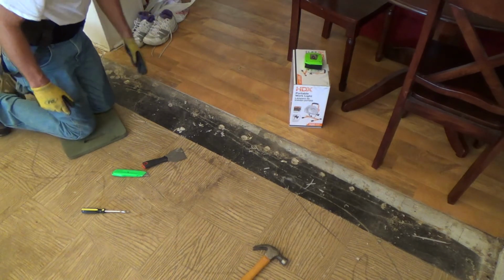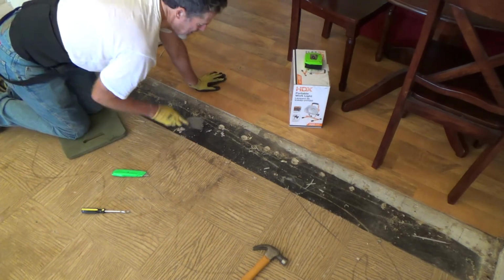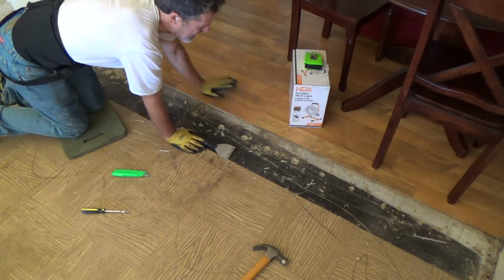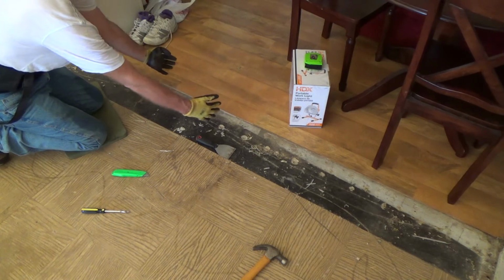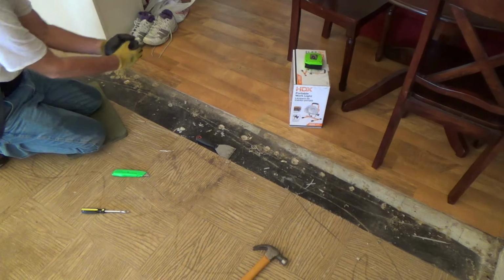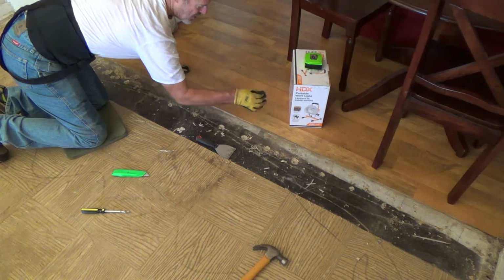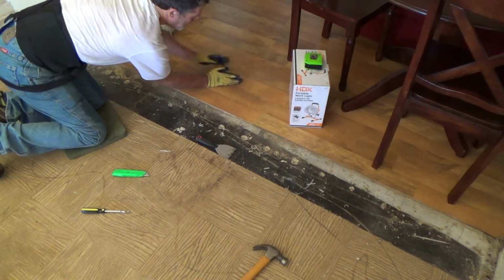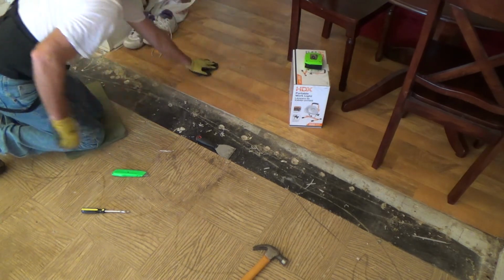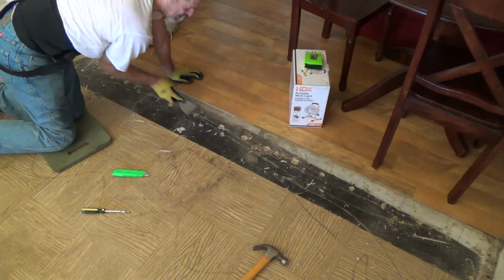That's why they've installed trim around the edges, because you want to leave a gap from left to right of about 5/16 of an inch. You don't want it tight, because if it's tight and if this gets moisture in it, it will expand, believe it or not. And if you've got it too tight at one end and not enough on the other, it could grow. And if it's got nowhere to go, guess where it goes? It puckers right at the joint. If it's from front to back, it'll pucker right here up at a little peak. You're going to feel that. You're going to be like, my word, how'd that happen? Well, that's how it would happen, because it was installed improperly.